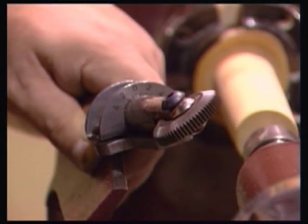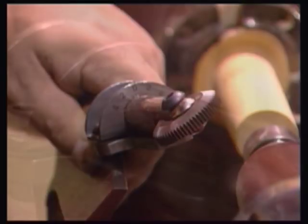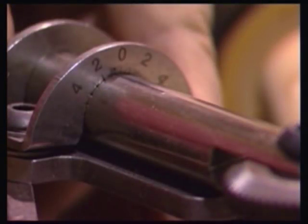Let's set the cradle up so that the wheel is tilted to one side, but not by too large an amount to begin with. Whilst we are getting used to the tool, a less steep pitch, with the tool offset only by a half to 1 full graduation, will offer less resistance and cut more easily.